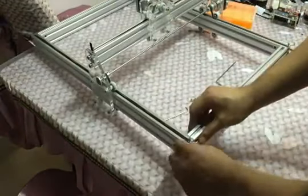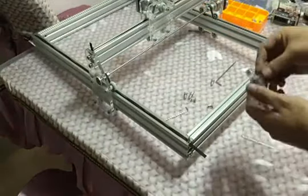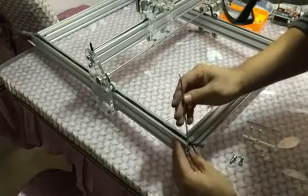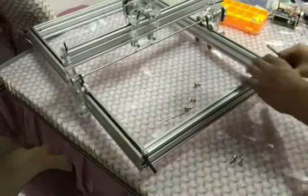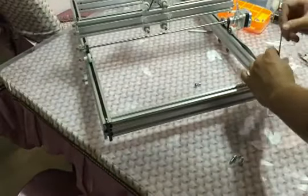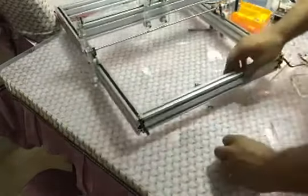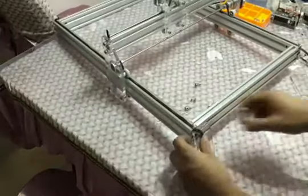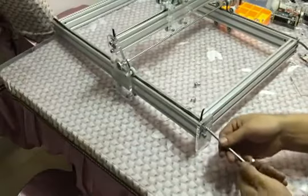That means you need to push the small bolt inside about 2 mm. You see, when I fasten the two acrylic feet, the acrylic plate will connect the aluminum ends together. So you need to make the small bolt inside 2 millimeter. All the acrylic plate will push the black belt and the bolt inside 2 millimeter. So you need to leave about 2 millimeter space on the end.